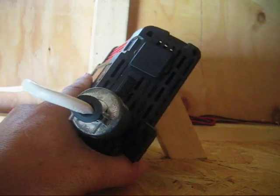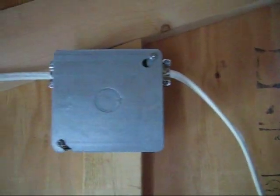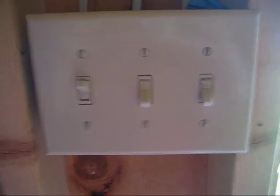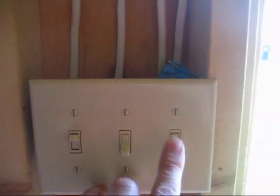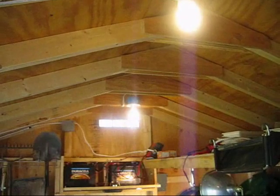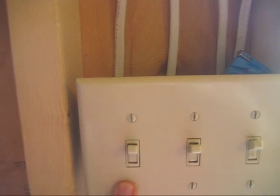In the event we lose electricity in the house. From there the Romex wire goes to a junction box where my connections meet, and runs along the length of the shed to the switches. One switch is for the light in the middle of the shed, a second for the light over the solar panel setup, and I have a third switch for a motion detector light on the outside of the shed.